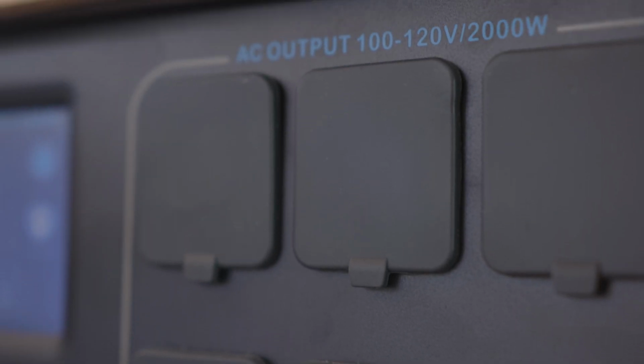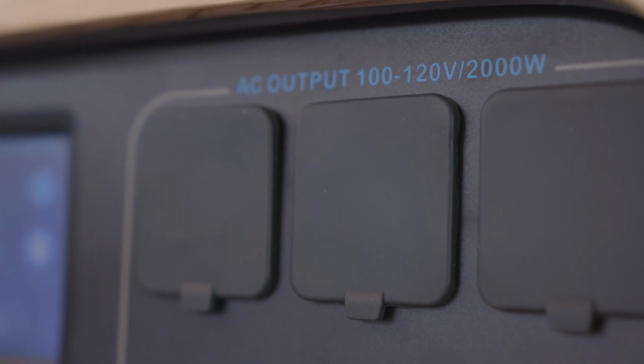They don't degrade nearly as much from temperature changes and are generally safer for long-term use in varying environments. The cost is they have less wattage density, thus they just take up more space than the equivalent lithium-ion battery. Many of the amenities carry over from the smaller unit, with the bigger difference being the much larger AC inverter in this unit. A 2,000 watt inverter means that you can power basically any household item.